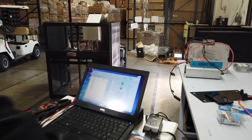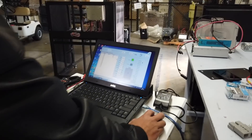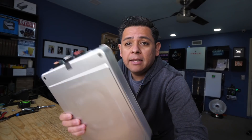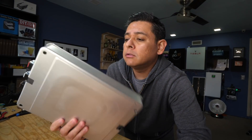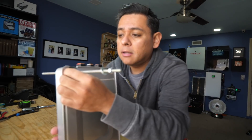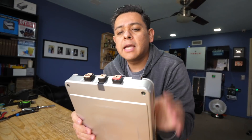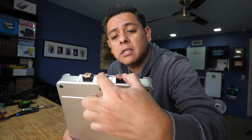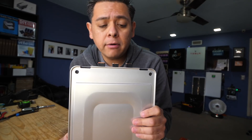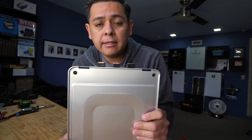So let's test one of these modules first, and then let's build it into a 48 volt system so that we can run a 48 volt inverter. Here is a Leaf module — these are made of pouch cells inside. These are the metal canisters they come in; they come with little holes so that you can stack them together, put bolts through, and then connect them together. It's got three terminals because it's got two pouches — so 3.7 volts plus 3.7 volts. These are advertised as 500 watt-hours. Let's capacity test one of these to see where they're at.